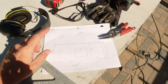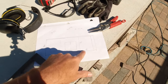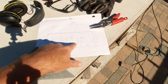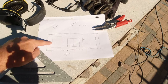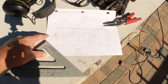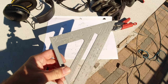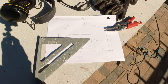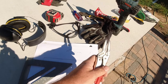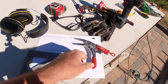Another important item to have ready before you start is a good plan. I've drawn out what my island and kitchen is going to look like - where my doors and refrigerator will be, with dimensions. Doing this ahead of time and thinking it through is going to save you a ton of time during the build process. I've also got my square here to make sure everything's square, and I'm using these needle nose locking grips to hold everything together as I put the screws in.